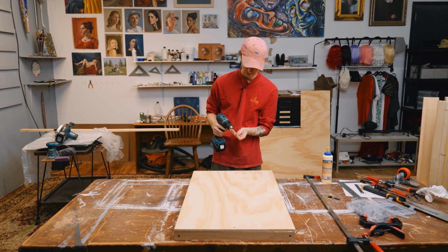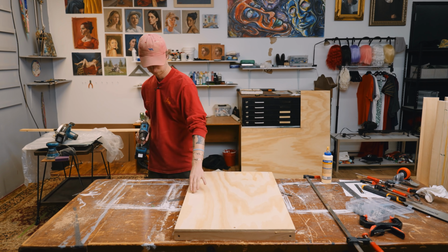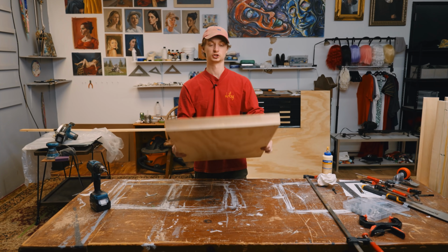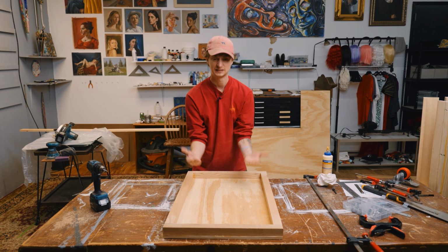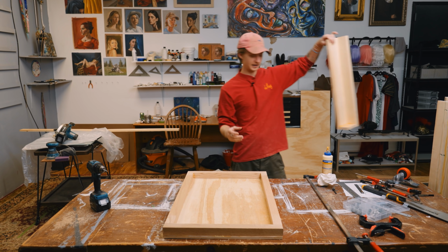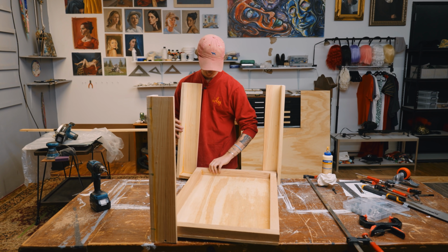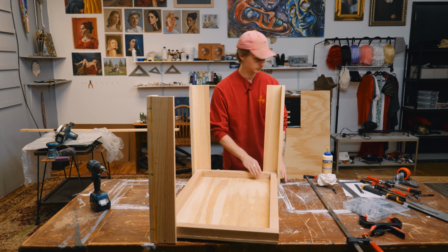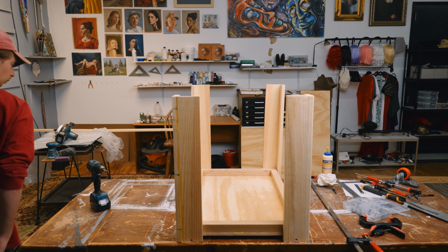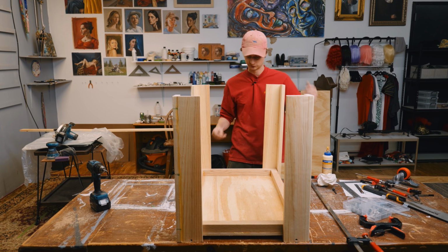Okay, I'm happy with this. Absolutely solid. Really heavy, which is good because we want the base to be heavy, right? We want the center of mass lower, because if it's higher, then it's gonna put stress on these legs. So it's gonna be weighted down. Now you can kind of see the actual skeleton of the cart coming together. Maybe it was unclear towards the beginning. Boom. I'm basically gonna do the same thing on the top, just reverse the box so it's just perfectly flat.